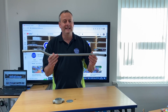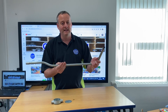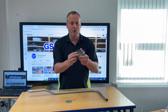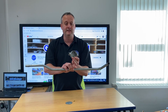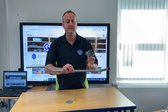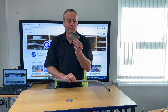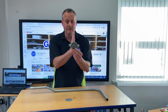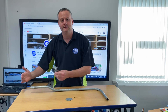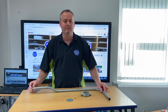However, they've just made it a little bit easier. You still have to put a set in it, you still have to put a bend in it, but they've now introduced a through box. In other words, this becomes two pieces of conduit — if you were to cut it, you would have a bent piece that you make separately from your set piece, and you join them together through this through box. There are measurements for it obviously, and the box needs to be in a certain position as well, but not being in one piece and now being in two separate pieces makes that assessment a little bit easier.